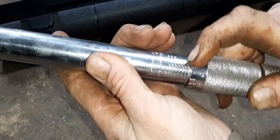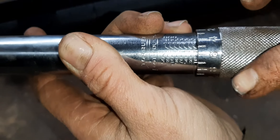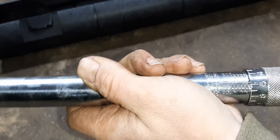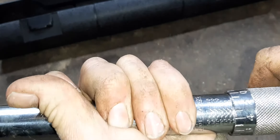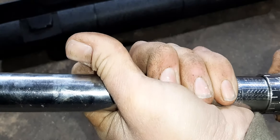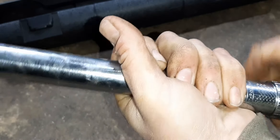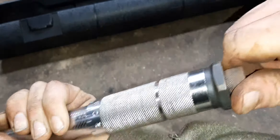It loosens this up. Up the side here — you have like 10, and then on the other side 20, and then 30, and 40, and 50, and 60. I'm going to be doing 41, so I'm going to spin this up. That gets me to 40 — 40's right there. So the dizzy lines are on the 40. For 41, you just go to this line down the middle, one past the one. Then you bring that back down which locks it.